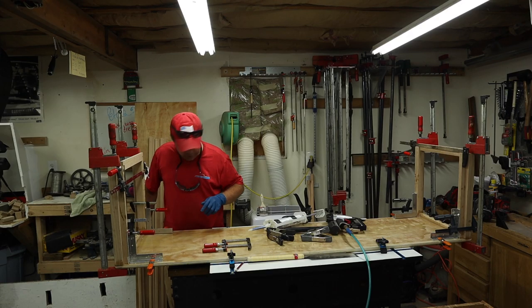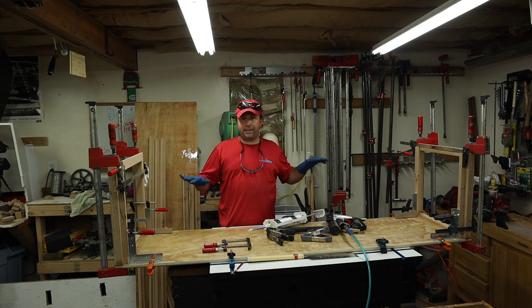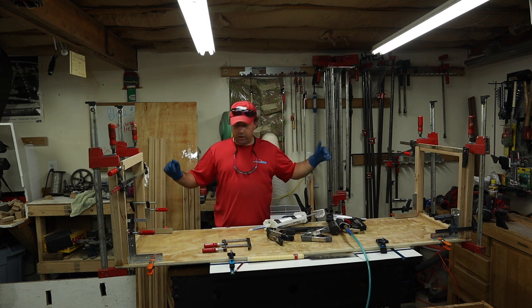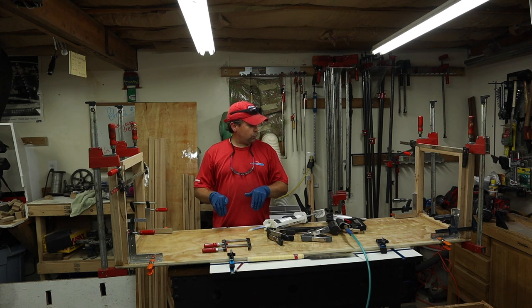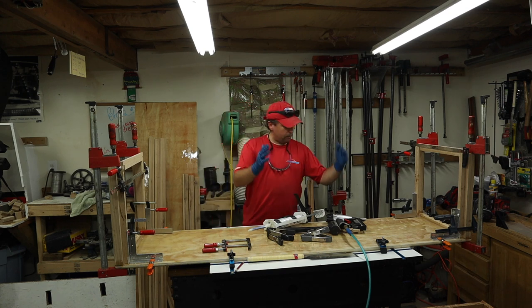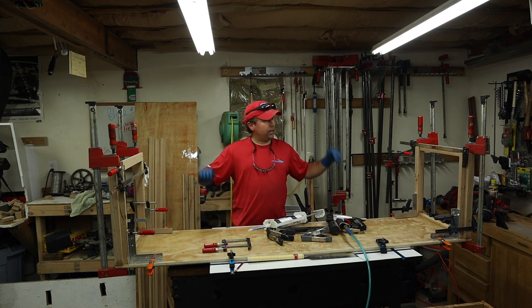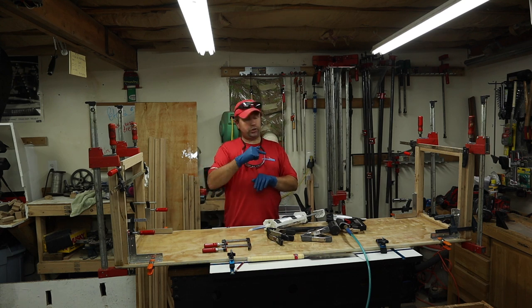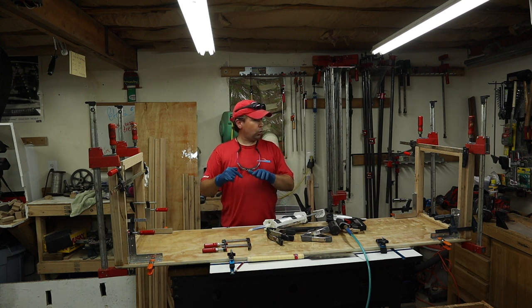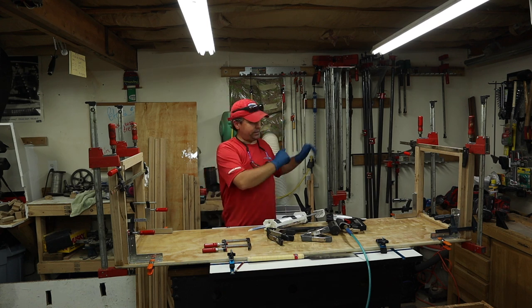All right, everything looks good. We'll let these end walls set up before we do anything else, and this is really all I can do for the end walls on these tanks because I only have 4 of these angle gauges and I want to use them on all of them. So tank number 2 will have to wait. Obviously, we still have to work on our baffles and our sidewalls and stuff, but the process has begun. So while this sets up, now we'll move back into the boat shed and start working on some of the panel stuff that's going to be installed on our diesel tanks.